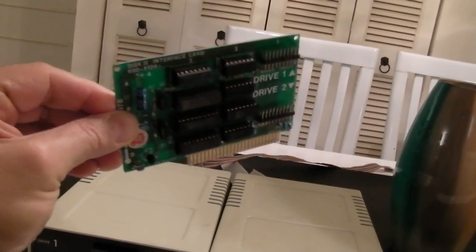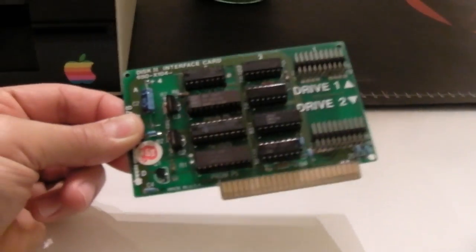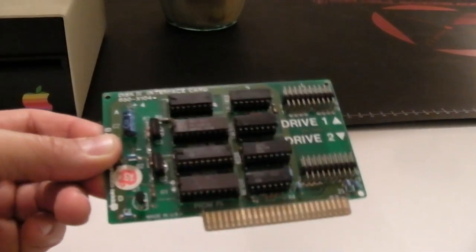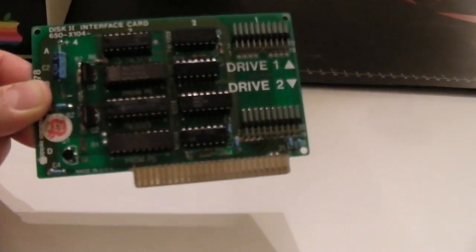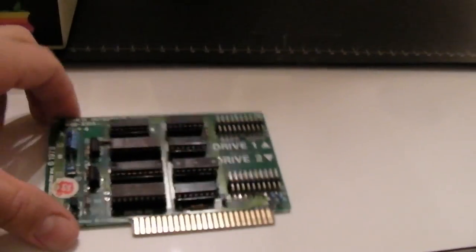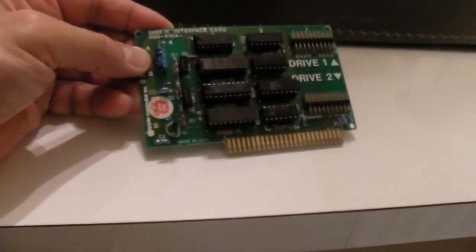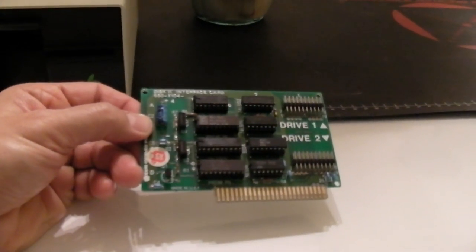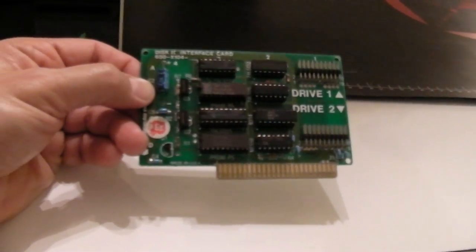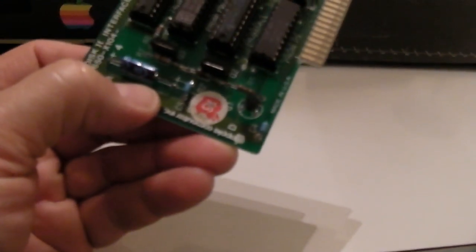But let me show you where the magic happens. The magic happened with this interface card — the Disk II interface card. This was the genius of Wozniak. There's really not a hell of a lot of components on this board — it's a very small, tight card. This was just art in engineering. The controller card accommodated two drives and you could put multiple cards into the Apple II because it had seven available slots. And if you notice on this particular interface card, there's a sticker that says 16 on it. Originally the drives held about 113K and it was a 13-sector drive, and there was a chip change that tweaked it from 13 sectors to 16 sectors, so we were able to pack a little more data on those floppy diskettes. This interface card was upgraded to 16 sector.